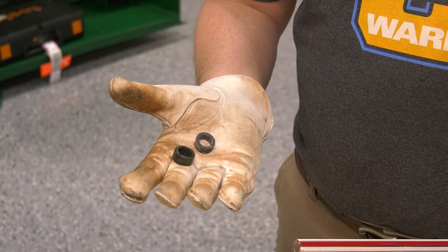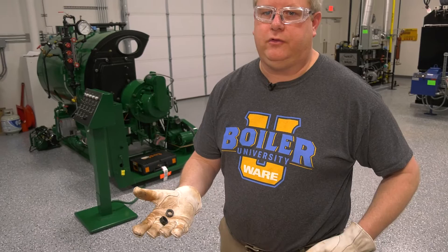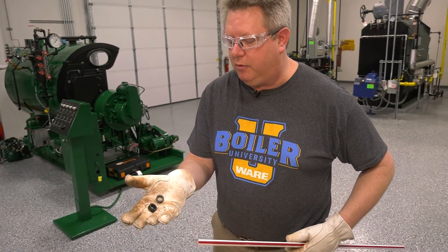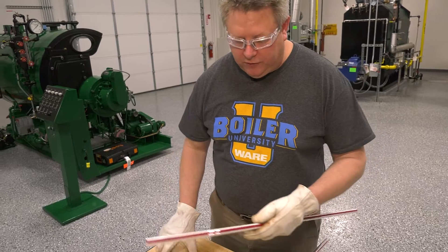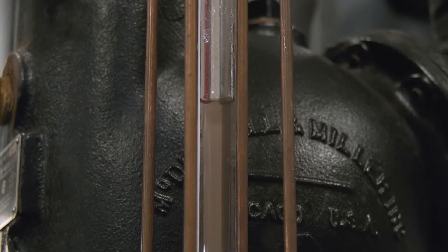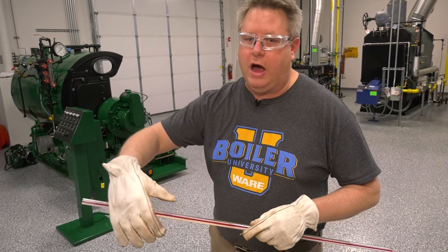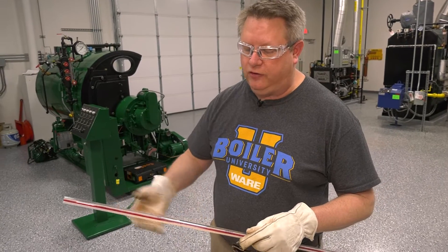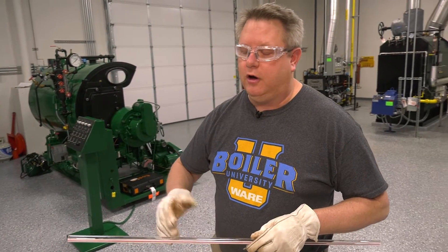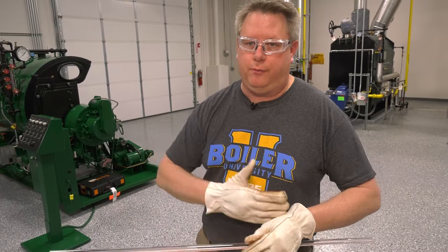You want to make sure that your replacement washers are the same inside-outside diameter as the originals. These are available in different materials and sometimes people have more luck with one type than another — these black rubber ones have worked well for us. This is red line sight glass, and the red and white pattern give you a visual indicator of where the water is because refraction makes the red line appear wider. It's a nice tool to make it easier to see the water level in the boiler. This is also rated for high pressure — it's got HP on there — so this would be suitable for a 150 PSI boiler, no problem, and anything lower pressure than that.